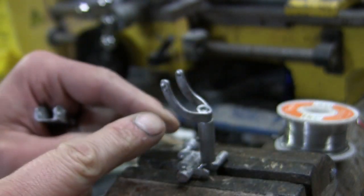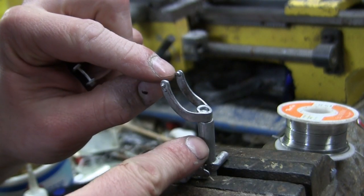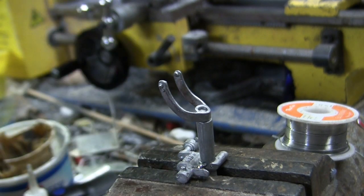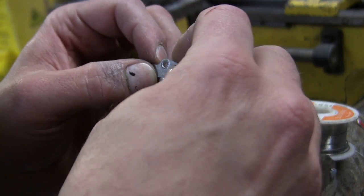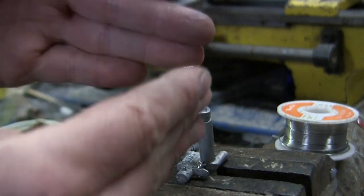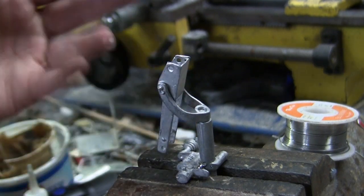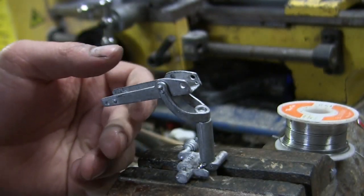The cradle is going to fit onto this unit here. Now you have to be very careful because you need to slightly pry open the yoke in order for the cradle to drop in place, because there are rotating knobs molded on the inside of these portions here. So you have to be very careful because you can easily overbend and snap this material. If that happens, your options start dropping very quickly on solutions for that. So be careful. Once they are in place, though, you're all set. Once the unit lines up, you just basically squeeze the yoke sections back where they need to be. You could use a plier, but I was able to do it just by hand. And now the piece is permanently affixed.